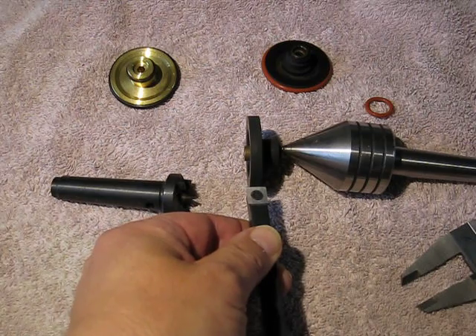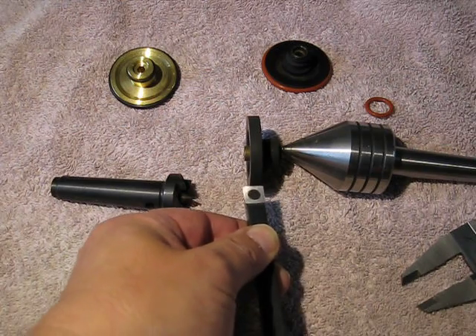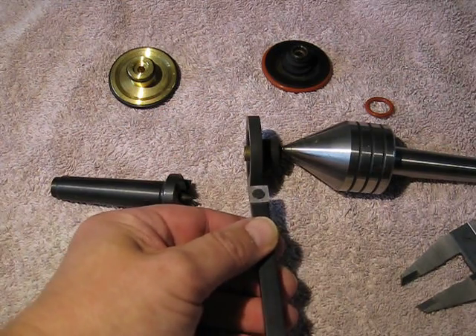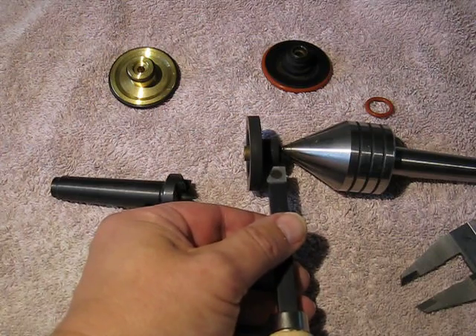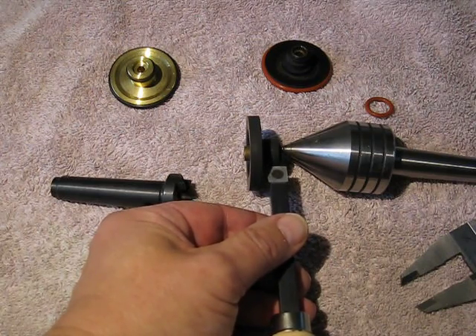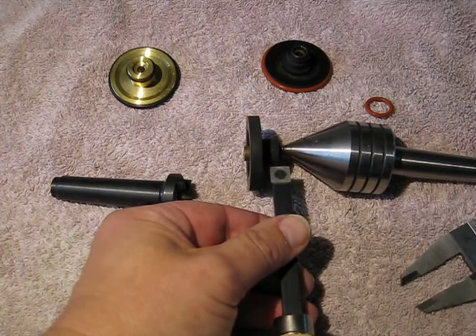The 45 players as a whole are generally never right on target at 45 rpm anyhow — these were designed primarily for kids and teenagers, inexpensive players to listen to your 45s. So the outer dimension on the larger of the two sections is going to be 1.625, give or take a fraction. The outside dimension on the smaller concentric area is going to be 0.625, and once you get it turned down to that point, make sure it's nice and clean.